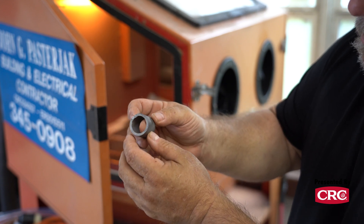The first and most major minus is that it is a destructive process. The media is not only impacting the rust and removing the loose rust, it's also affecting the surface. How much it affects your workpiece depends on the hardness of that surface — a hardened steel piece will be affected less than mild steel, but there will still be permanent etching. Also, the equipment itself is not inexpensive; you can pay anywhere from $100 to several thousand dollars for a blast cabinet, whether a benchtop, freestanding, or a large shop model with dust extraction.